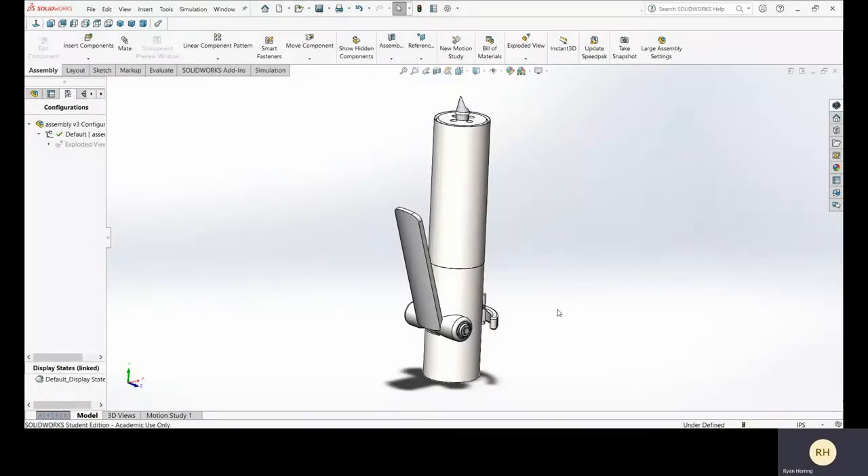Here is the final model, which we used to manufacture our oil filter puncture tool. It consists of 20 total components and features a steel tube body with various machined steel and aluminum components. Six of which have been purchased from outside vendors, and all others have been machined and fabricated by ourselves.